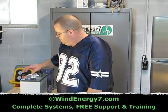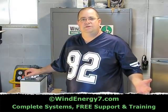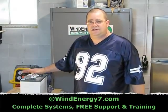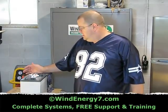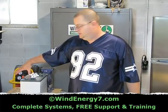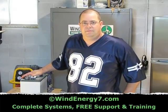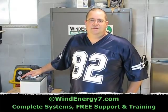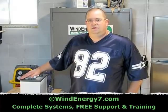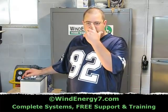You want to be able to add the same battery into a battery bank — it's important that your batteries be the same. If you go to Sam's Club to get another battery, they might not have the exact same match. The specifics of batteries are voltage: these are 6-volt deep cycle, and this is a 232 amp-hour battery. If you go to replace this with a 210 amp-hour battery, it's not a good thing. You need to maintain the same amp-hour spec — they need to match. Six years from now, if you have a battery go out, you'll be able to get this battery. Who knows what will happen with a lot of other battery manufacturers.